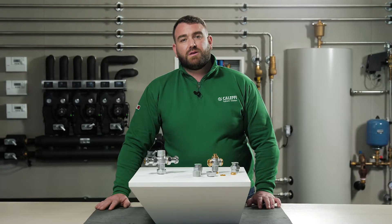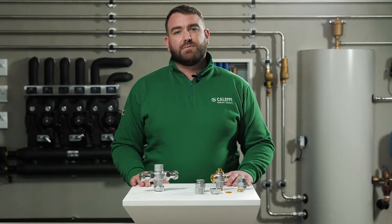Firstly we'll talk about the reasons why we use a mixing valve, TMV, or the applications these are used in. A thermostatic mixing valve or TMV is used to deliver a safe constant temperature to a user. It also has a built-in failsafe function — if the cold water supply was to fail, the user would not get scalded. Since the early 1990s, a method to evaluate and certify anti-scald temperature control devices was in high demand in both the healthcare and domestic markets.